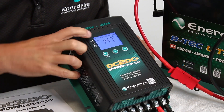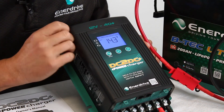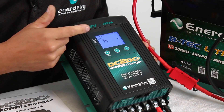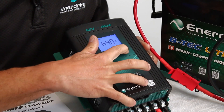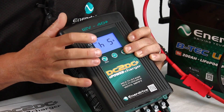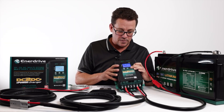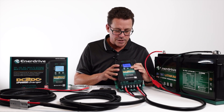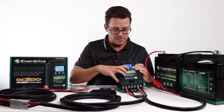The default battery type is set to AGM. You can scroll across through all the different options — the flashing one is what we're looking at. Press the set button as your enter button. So we're now using this for an AGM battery. The H40 value is the maximum this unit will output — default is 40 amps. You can change it down to 5 amps, or 10, 15, 20, 25, 30, 35, 40, 45, up to 50 amps. Let's put it back to default. The reason you'd change this setting is according to the size of your battery, which we'll touch on later.